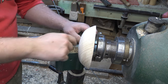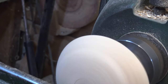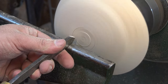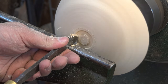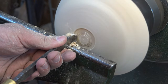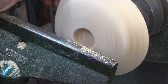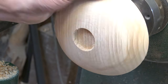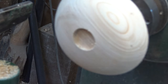So there's the side profile — we're getting this nice curve. It's just making a little mortise that we can remount this onto, and it's also going to become the mortise joint for the top. I'm going to want to try and make this piece look like water next and match that up with the fire. So I'm going to use a little Japanese technique called Shou Sugi Ban, which is essentially burning this with the blowtorch. I think we're going to use this on quite a few of our pieces.